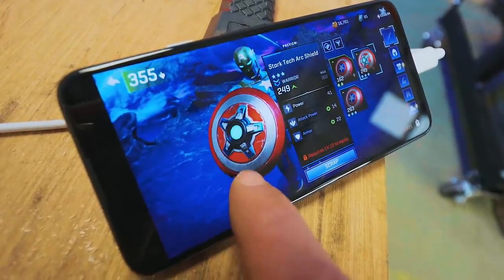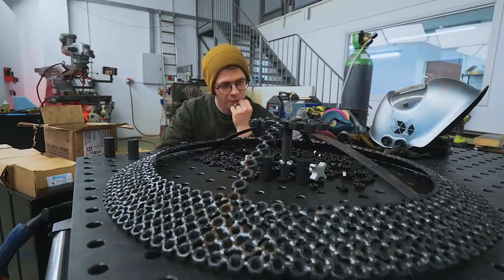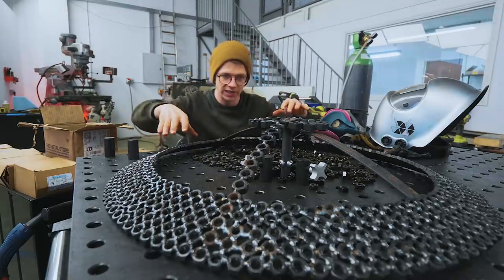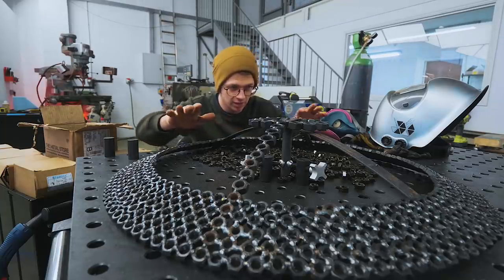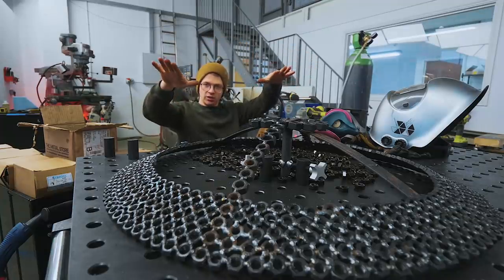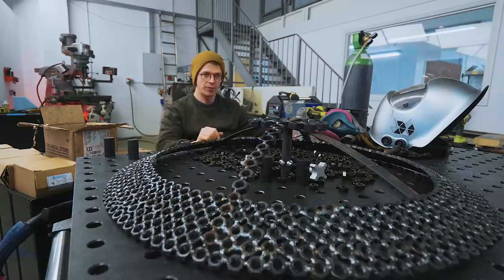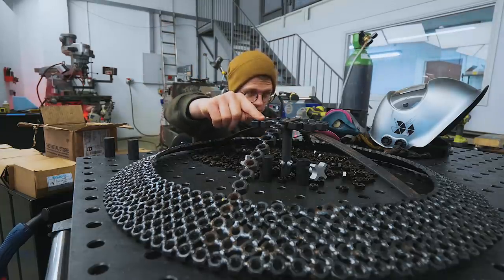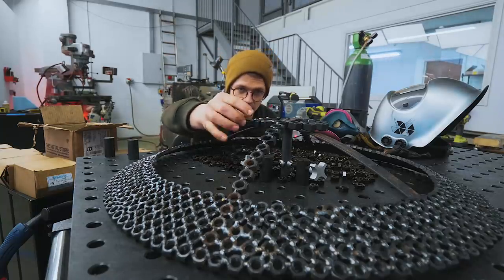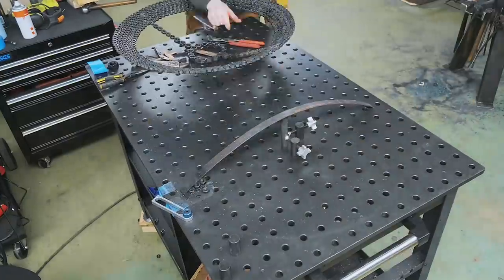So we've got that outer red ring done. Now this inner silver ring is going to be made out of these 12mm bolts. But actually, I'm not so sure if it's wise to start on the middle ring, because something peculiar is happening as I weld this — the middle bit is rising up, shrinking the nuts from the top and giving it less curvature. So perhaps the trick is we start with this ring of 16mm nuts first. I don't know.